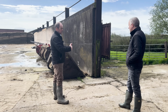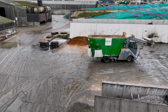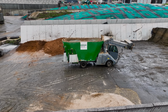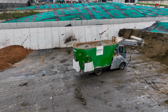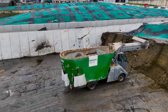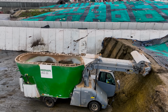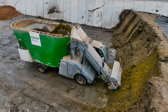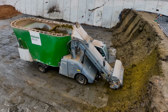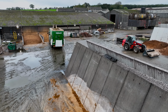Several different ways of doing it. It's basically like a wall panel but stood on its end vertically, sits in a cradle, which is concreted onto a footing, usually up to a metre below finished floor level, and then you pour concrete either side of that, and that basically is stood up and is structurally reinforced to take weight from both sides. Not a common construction in the UK, but for a double-sided panel is quite cost effective.